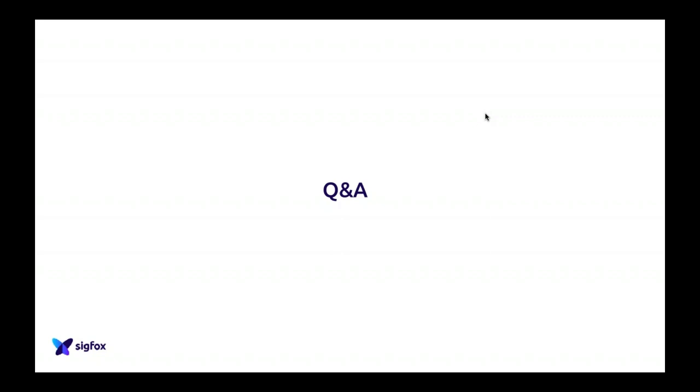The second thing is the antenna. You can have the same antenna to achieve multiple zones. Again, the Sensit antenna is optimized for 868 megahertz, 902, and 923, so the same antenna works for these three zones. But it was really complex to design. It was a complexity in the design which was not easy to handle. So this is not impossible, but you have a lot of different complexity to understand before going into that.